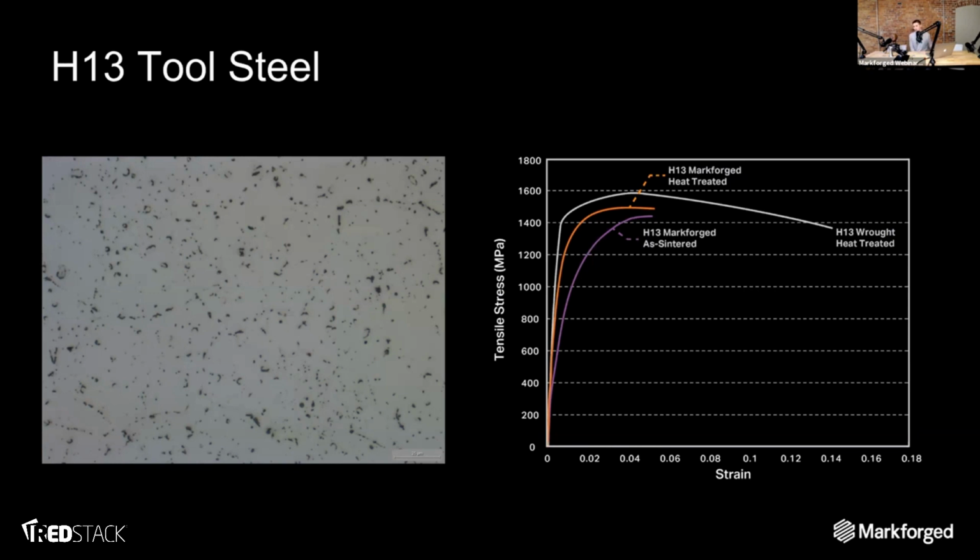So generally what you do is you temper or even double temper the steel afterwards. The temperature you temper it at has a pretty heavy control on both the toughness of the steel, so how much bend, how much malleability you're going to get, and the hardness. What we recommend is about a 600 degrees C temper, and what that yields is that 45 HRC that you'll see on our data sheets if you've seen them before, and you'll see again if we are able to find it after the webinar, if Marco sends it out.